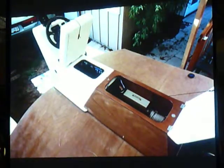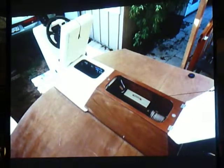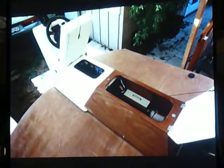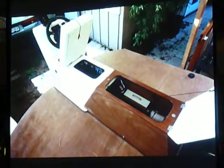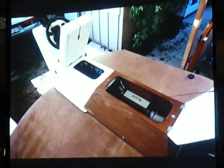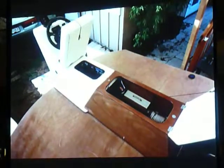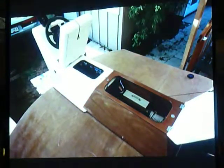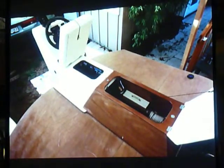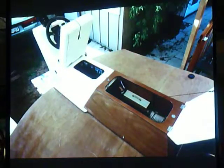So there's access to all the electronics. When you let off the gas, it goes down, right? Oh, yeah, sure. It does slow down, but it has much more drift than your typical planing hull because it doesn't have that suck back at the back of the hull. And once you let off the power, the boat's just drifting forward. It's interesting, if you're used to a regular boat, when you let the power off, it stops. Well, this one doesn't, so if you're coming into a wharf, you've got to be careful because it keeps going. That's right. And if it wants to go straight, it doesn't turn, unless you put it in reverse, in which case it will.